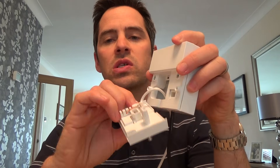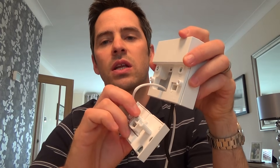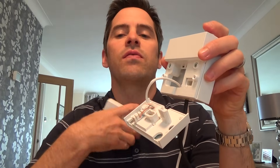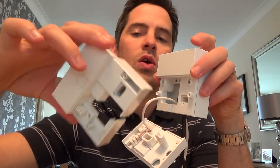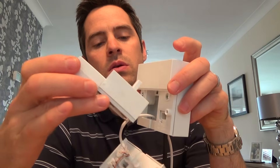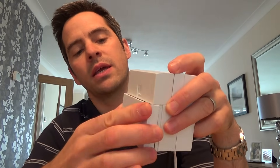You just need to undo the two screws here and slide out the extensions. Be careful when you're sliding them out — don't yank them too hard as they may not be cable tied, so just nice and gently slide that out. The VDSL faceplate has a cutaway for the cable so you don't need to undo any of your wiring. You just plug it in like so and then plug your faceplate back in.